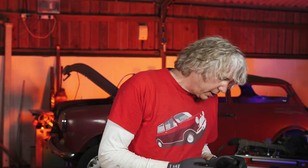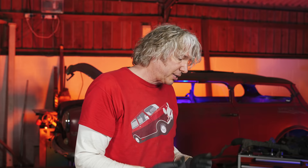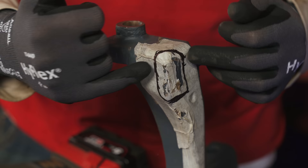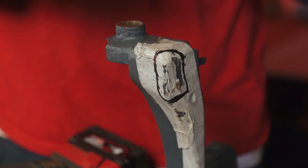What I want to do first is think about the metal I'm going to be putting back in. This is about 2mm thick, so I'm going to use exactly the same steel to put back once I've cut out what I'm removing. I need to accommodate that thickness in the hole I'm removing, so I'm just going to make these markings a bit bigger to accommodate an extra 2mm, and then I can start chopping away and start thinking about filling it back in again.